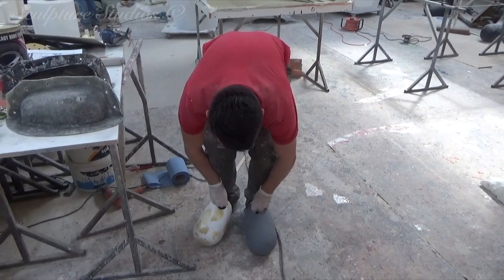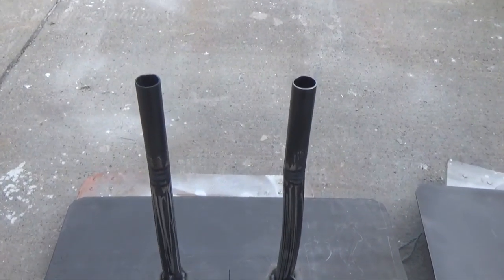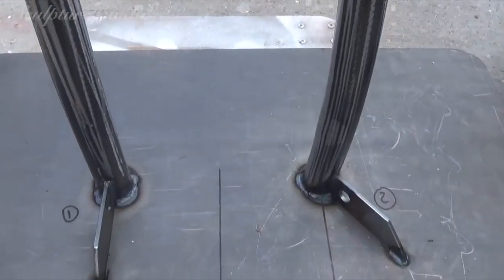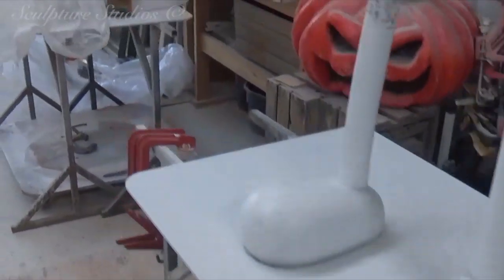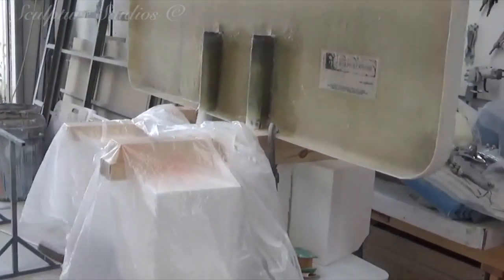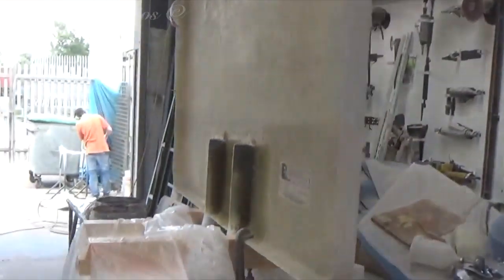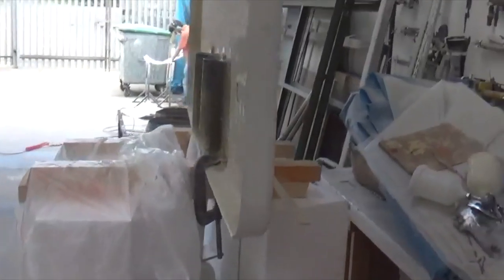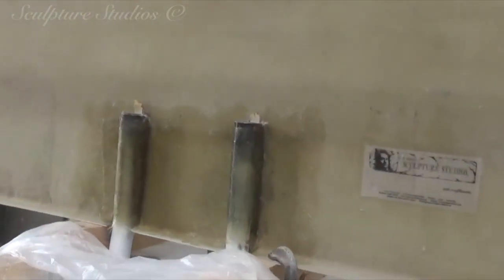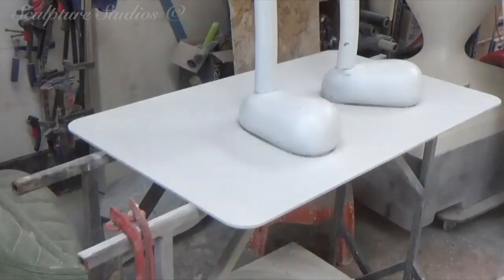We've created four fibreglass casts from this mould, where they're then trimmed, the seam lines from the join in the mould are cleaned up, and metalwork has been created to go on the inside. Martin from Fine Limit Welding has created a nice solid plate here, and welded upright supports that'll double as the character's legs. These are laminated into the job, alongside a little compliment slip, so anyone that opens these will know where they came from. Once all the construction side's complete, the two pieces need to be joined together, and the exterior seam line cleaned up, so this appears as one completely sealed unit.